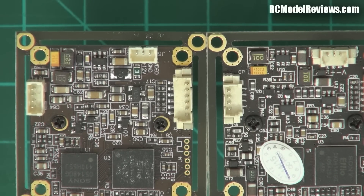This is going to be a two-part review. I'll do the bench work today and the flying portion in part two. Other people have reviewed these before, but I want a side-by-side comparison. One issue: this is an 800 TV line camera, and most DVRs we use don't have enough resolution to record that. So I'm going to use my old Panasonic DV camcorder, which has 720 lines of recording resolution, to better show the difference between this and the 600 line camera.